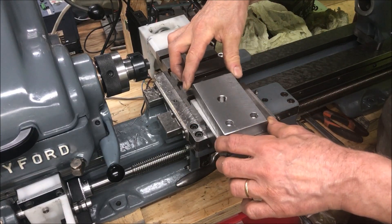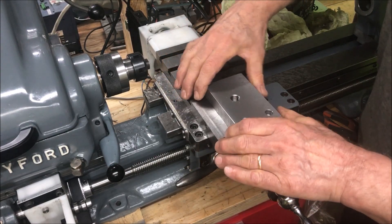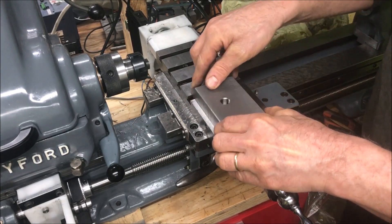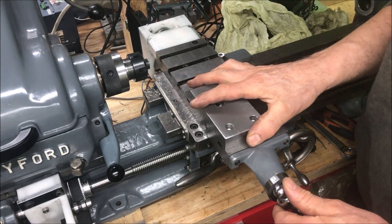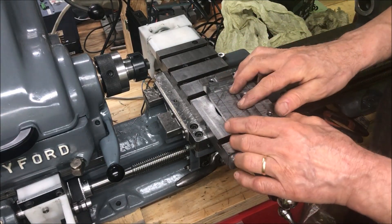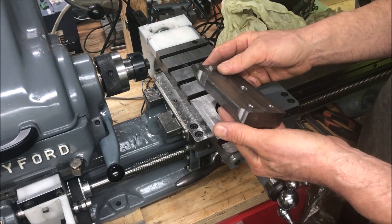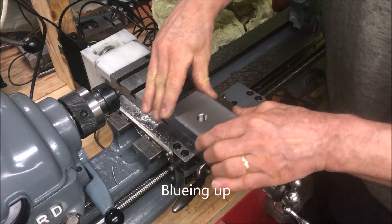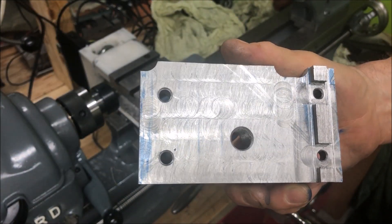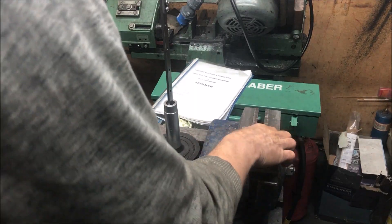Other viewers pointed out: how do you know if this sits flat? At this stage I don't, so I have to test it. You could verify that it doesn't bind up and probably sits okay, but it shall have a static fit of five points per inch. I will also show how to scrape steel — it's very tight in the T-slots — but that's not a good five-points-per-inch static fit. So to prepare for the scraping of this...